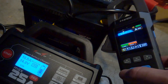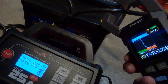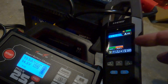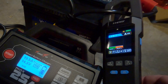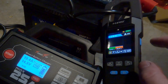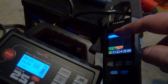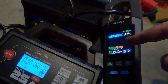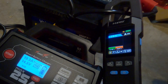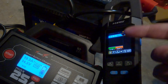That is a little strange — it looks like the meter might have ran out of memory or something because it just flatlined right there. I'm going to disconnect and reconnect. The reference meter shows 19.7 and this one shows 19.5. The waveform on this guy dropped back down again, which is a little strange. You can hit this button to do a little save. I think what it's doing is once amperage stops changing, it resets the base level — it has something to do with its auto-scaling.